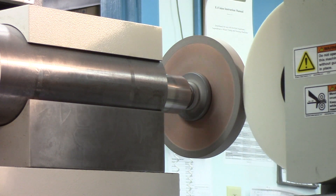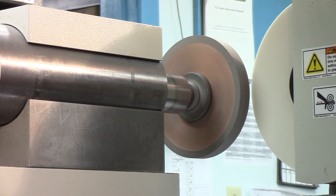We spent a couple of days doing these tests and will spend the next few weeks processing the results — typically processing takes longer than the test if you're going to do it right. The parameters we're looking at include power, the forces being generated, and basically how quickly we can true and dress the diamond wheel.